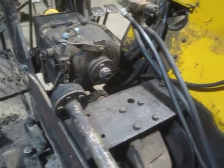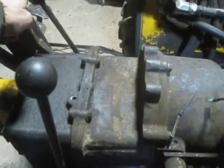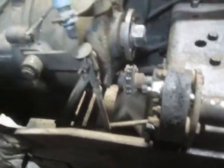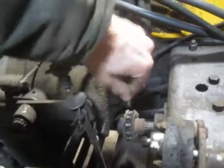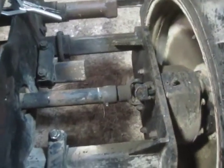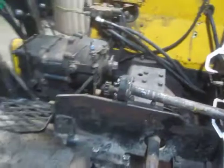These Haxco FTG tractors were built in a machine shop in Wisconsin where they built transmissions and differentials — it's all modules. There's the clutch, and then the clutch is on the rear of a sliding gear transmission with two ranges forward and one range reverse, and three speeds with no synchro mesh. If I spin the input shaft counterclockwise, the output shaft beneath it turns the same direction, going into the diff and out to final drives at each wheel, advancing the tractor forward.